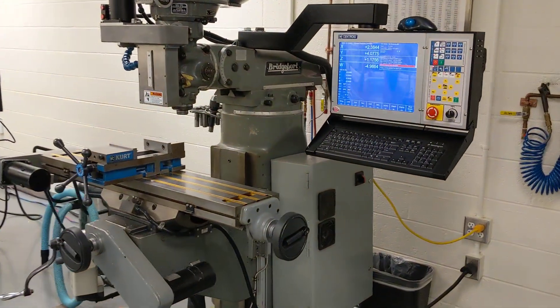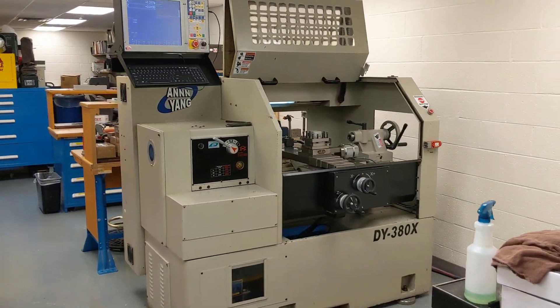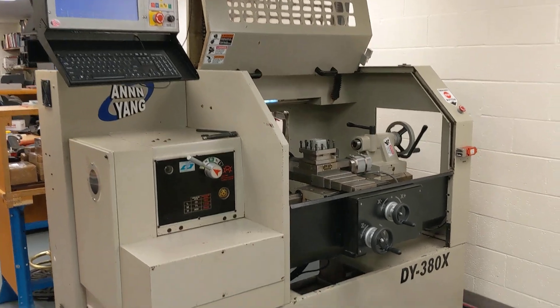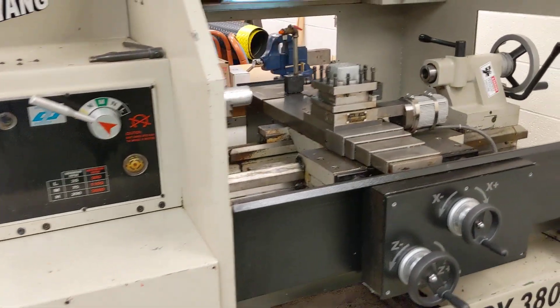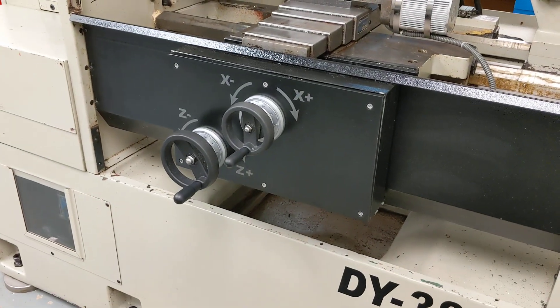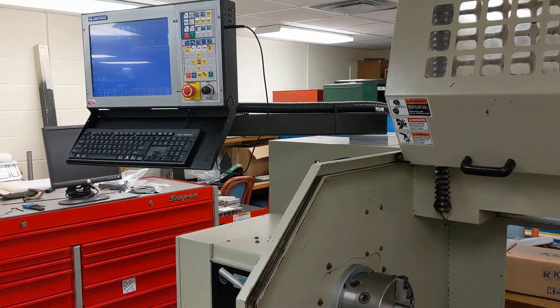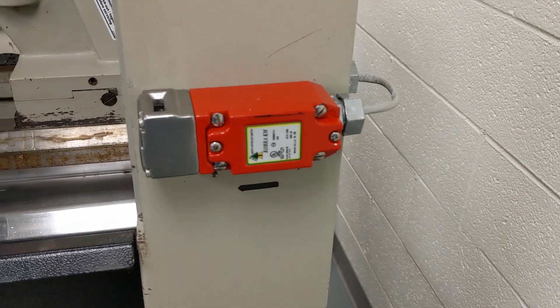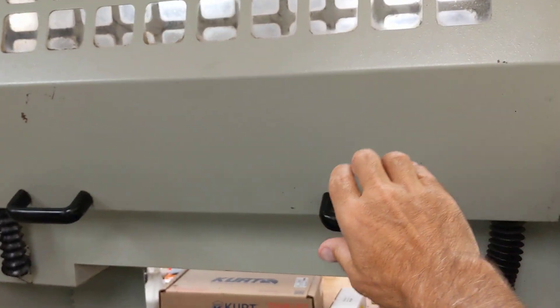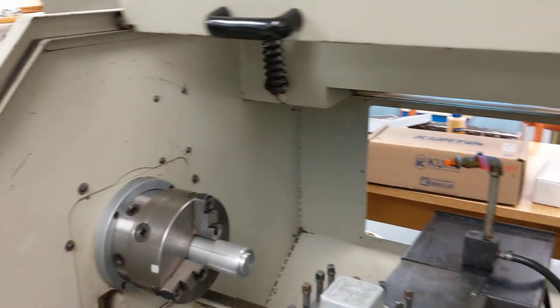The last Centroid in the shop on this visit is a T400-equipped An-Yang lathe. This is a flatbed lathe that originally had an Anilam control on it, so we were able to reuse the Z-axis and X-axis servo motors. We also upgraded the hand wheels during the retrofit and installed a Chinese electric four-position turret, getting that all configured up and running with the Centroid T400. We also installed a safety switch since this is a student shop — the spindle will run only when the door is closed, and if it's running a job and you open the door, it stops the spindle for safety reasons.